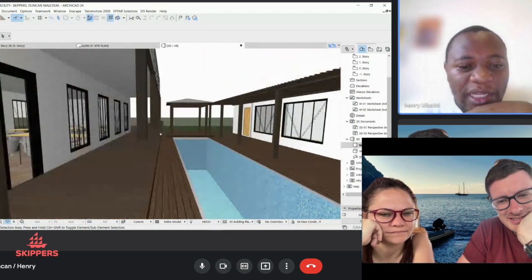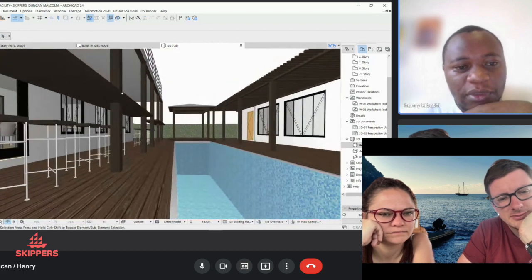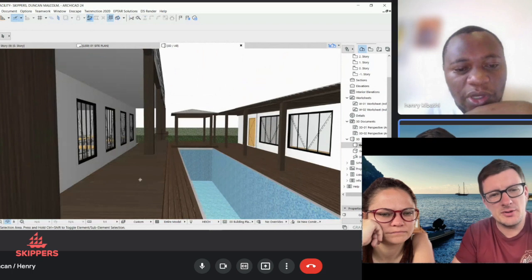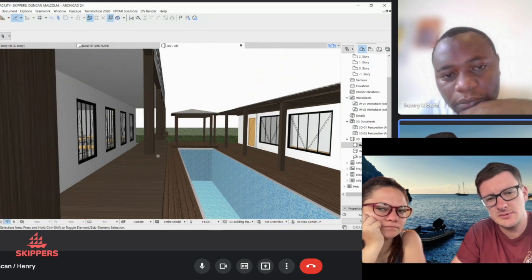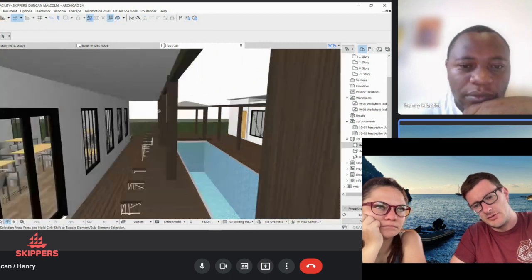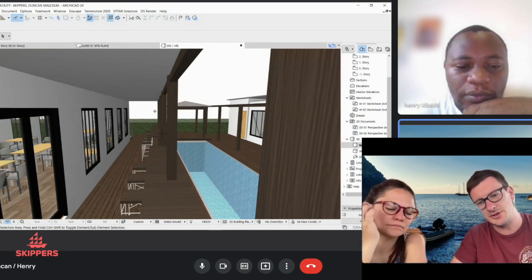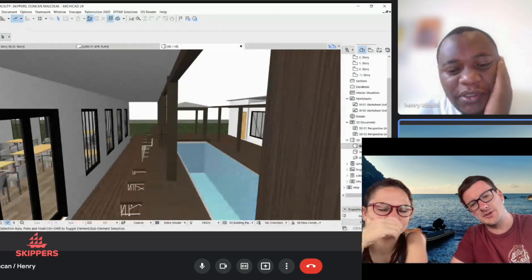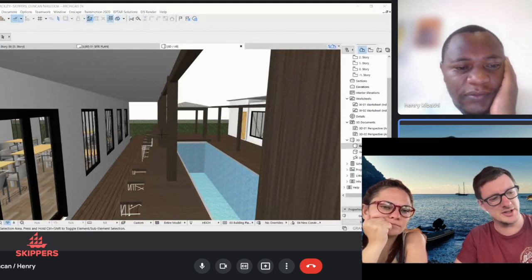We can run our electrical cables under this desk or timber platform. So it comes up with a pole, and then our sockets are mounted on the table. Yeah, I think the best thing to do here is going to be to put the sockets on the ceiling at the top of the posts. We'll put our own power adapters in them, and then we'll leave low voltage cables that people can use to plug in their equipment if they want to. So it's got 230 volts on the ceiling, and then just coming down is an extension cable, with a phone charging cable or a laptop charging cable.